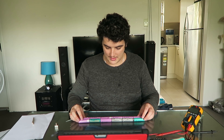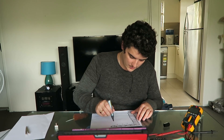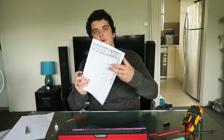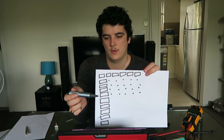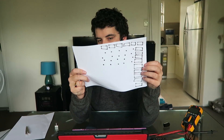So the setup would be 6S10P — 6 in series, 10 in parallel — and that's being conservative. You could probably draw more than one amp out of each cell, but to be conservative you limit the current. The lower the current, the longer the battery is going to last. And also the more you have in parallel like that, the greater distance you're going to be able to ride your e-bike, because there are more amp hours — more is better.